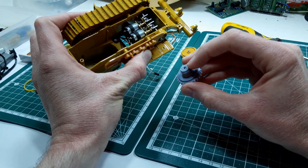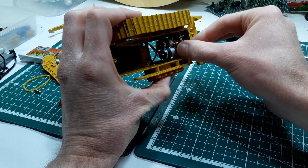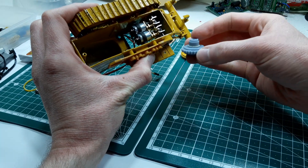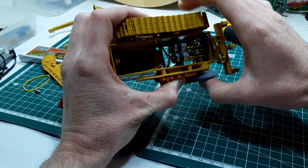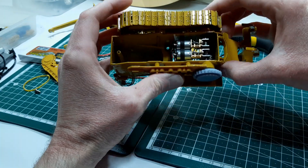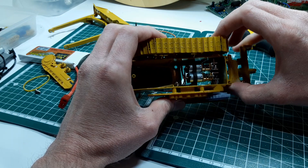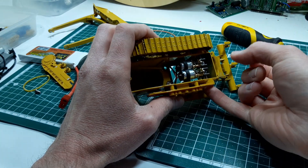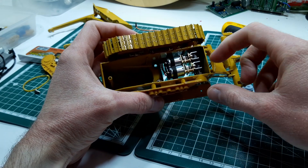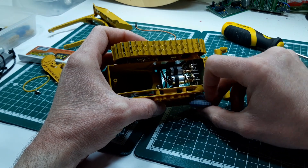I probably need to add some spacers between these motors and the wheels, or maybe just extend the actual wheel part to make it longer so that it goes the whole way in. Originally the motors were going to be right up against either side, but those motors being able to move slightly means the tolerance isn't as important. That should keep things smooth, but at the minute they can move out of alignment — we pretty much want them perfectly straight, but there's a possibility they'd swing to one side, although it's unlikely to go that extreme because they'll be held in the centre by the actual gears.